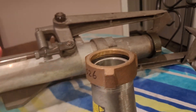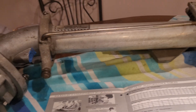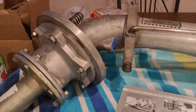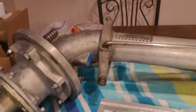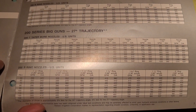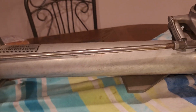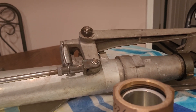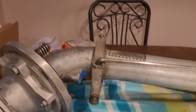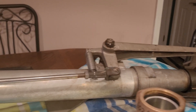I do plan on getting some stops as soon as I can find someone with a broken 200 and buy the stops off of it, or just buy the broken gun and pull them off myself. That's pretty much the specs — the Nelson 200 is considered Nelson's biggest gun, a high-volume gun, up to 1,300 gallons a minute and about 300 feet in range. I've seen a lot of them on travelers watering fields of beans, corn, and stuff.